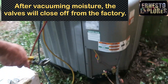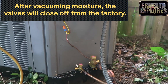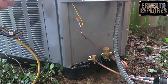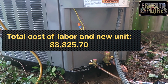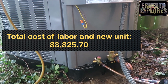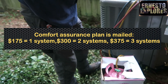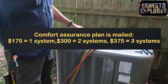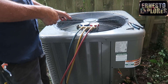What's the next stage after the vacuum stage? After that, these valves were closed off from the factory — Freon was stored in the compressor. I opened those up and allowed the Freon to go to the evaporator, and after we started running it, I had to add a little more. But now we don't have any Freon leak issue — I had 300 pounds of pressure on it for a while and it didn't move. This Freon — R-410A — produces more pressure; before it cuts off, it's right at 600 pounds of pressure. That thing's tested for 450 pounds, but normally you're not going to run 450 pounds. If it gets stopped up and runs a hot head, it can get up to 600 pounds before it shuts off.